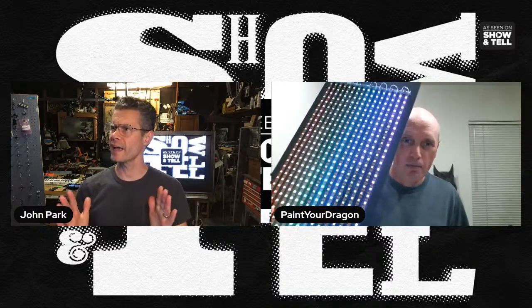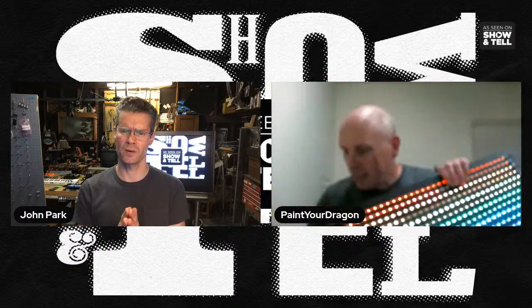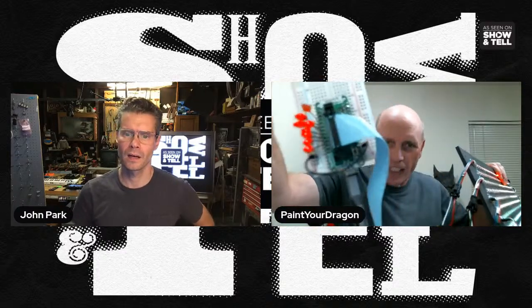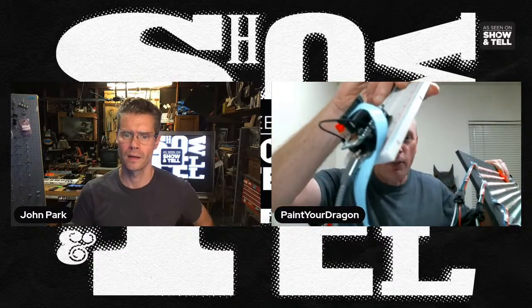And we have a Feather Wing that's designed for plugging a bazillion things in, right? Yeah, that's what I've got on there. Sorry, my cables are only so long. That one was originally designed for the M4. The cool thing with the ESP32 is you can just route any signal to any pin. So we didn't need to design a new Feather Wing for this. We can keep using the M4 Feather Wing, and the software just works. It just routes the signals to the same old pins, and that's pretty exciting.